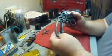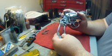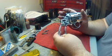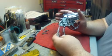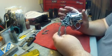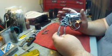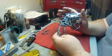And what I see a lot of people do is they have the strain on the spring, and then they start working the action, and you're putting strain on that pivot pin, but now it's not supported on both sides. You run a chance of breaking that pivot pin off. It sucks. Now, it's not going to happen every time. It's not going to happen the first time. It's not going to happen the second. It may not happen for quite a while, but at some point that will break.